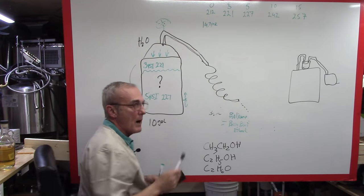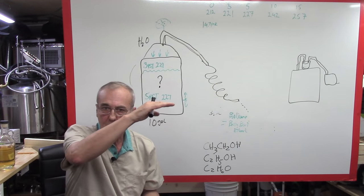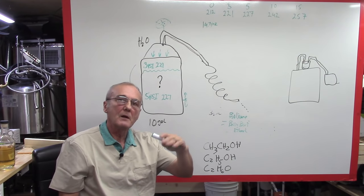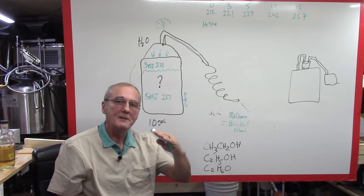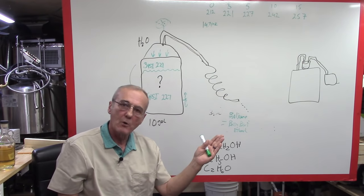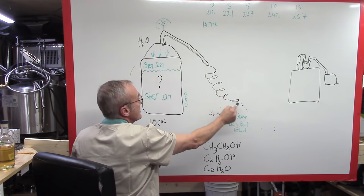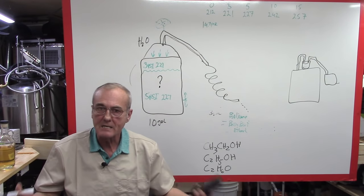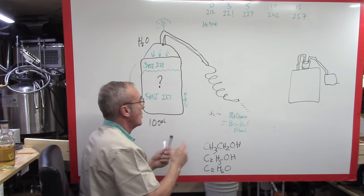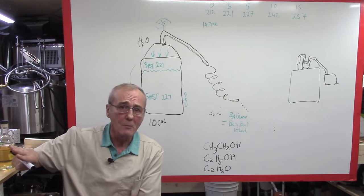One single distillation, this is a pot still. If this was a reflux still where you had multiple distillations on separate plates, this would still be an open system, so you should not have any rise in pressure other than what would be naturally acceptable. And naturally acceptable pressure would be 1 to 2 PSI. That's just based on temperature and restriction in flow into your worm, which causes a little bit of back pressure, something that's easily overcome because it doesn't build to a point where it's a forced restriction that you have to overcome. So removing a thumper removes a whole lot of complexity.